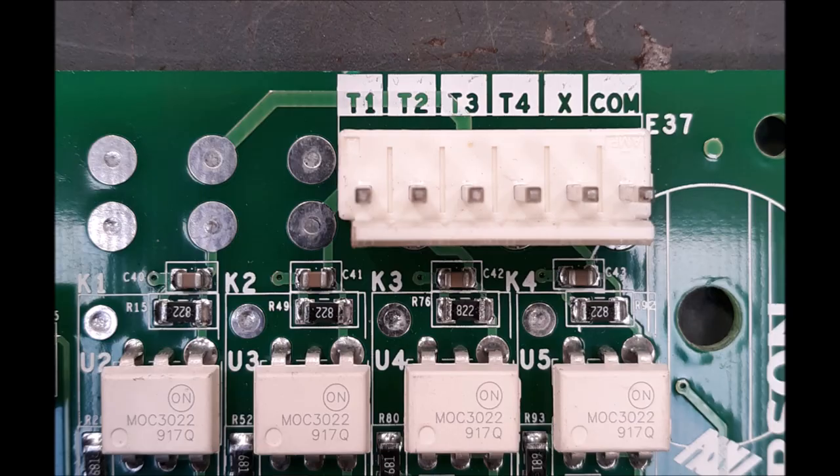Moving away from the plug, you'll see a six-pin plug in one row — not like the main plug with 12 wires. This is where your X13-style blower motor hooks up. The X13 motor has high voltage on it all the time and waits for a low voltage signal on one of five taps. You'll see T1, T2, T3, and so on, with the last one being common. These are all 24-volt pins, and you can check voltage to ensure the board is sending out that low voltage signal to the X13 module. In our case we're only using four of the five taps — tap five is marked with an X indicating it's unused.